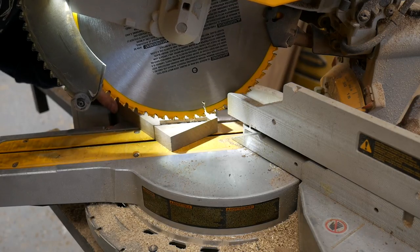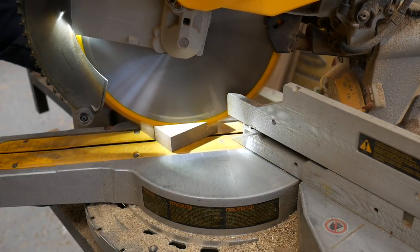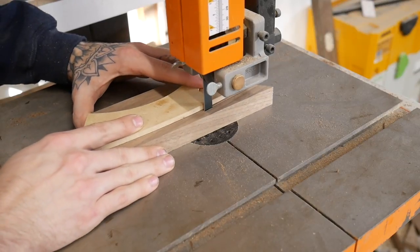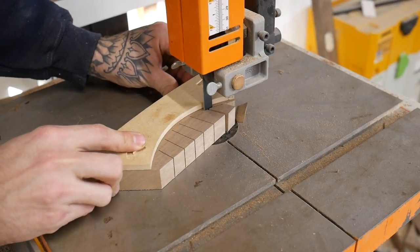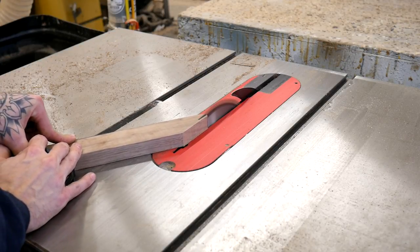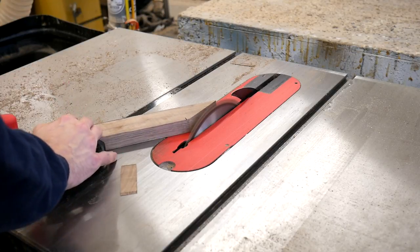I made a few renditions of this top piece. The first two I cut with the arc in the shape of the template, but that didn't give me any square surface to make nice clean cuts. So after remaking those, I cut the angles of the top piece on the miter saw and then cut the angles of the legs on the table saw. What I should have done was just made a quick sled on the table saw to make nice perfect cuts — it got the job done, but it would have been way easier with a simple throwaway table saw sled. Just keep some plywood and scraps on hand and you can quickly make something. If you watch Four Eyes Furniture, he does this a lot and that is exactly what I'll do if I make these again.